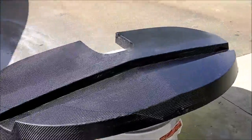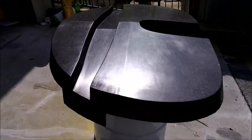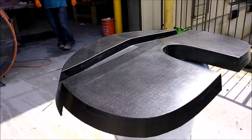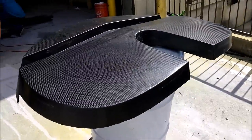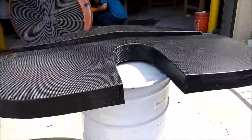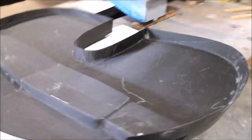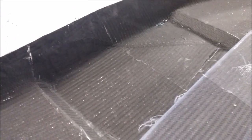The forward bulkhead has been popped out of the mold and trimmed off — it came out pretty well. There are a couple of small imperfections due to the complexity of the channel for the spar, but by removing and simplifying that we'll have fewer problems. The quality overall has actually come out really well compared to carbon fiber I've seen elsewhere. Here's the inside showing the hard points where the carbon fiber was vacuum-squashed in around them, and the locations where the pressure outflow valves will go for the pressurization system.